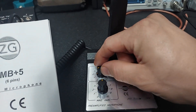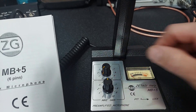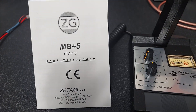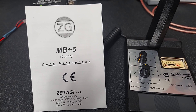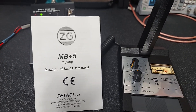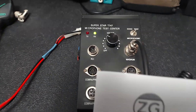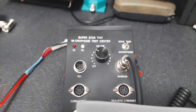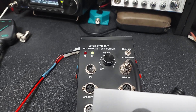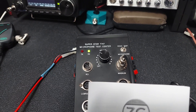This is your microphone gain and this is your tone. I find that anything over about two for my voice is kind of overkill on the highs — I actually like about one. This mic is wired directly for President six-pin radios, any Tone Quad six, CRT 9900, for you guys in Spain and parts of Europe the Dynascan 10M66, any variant of the AT6666, the Magnum 257 HP — those radios will work plug and play. Also the Bearcat 980, 880, and various President models with the six-pin.